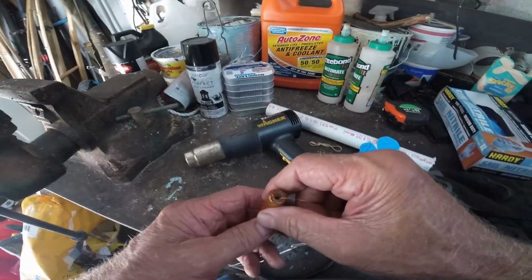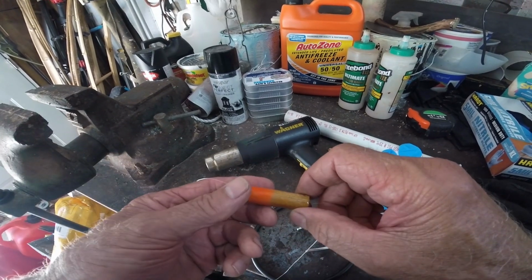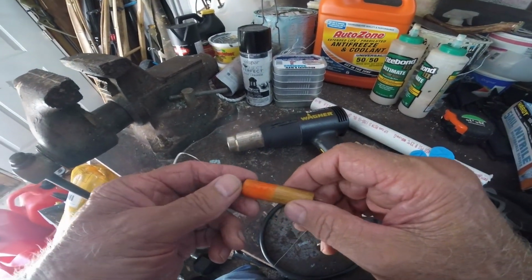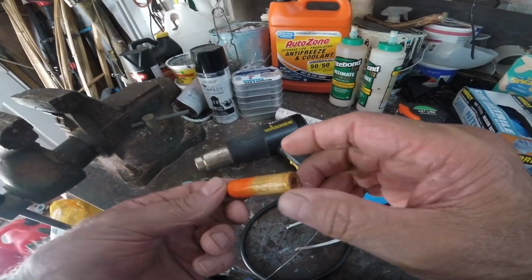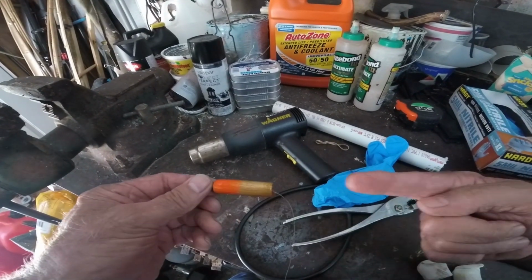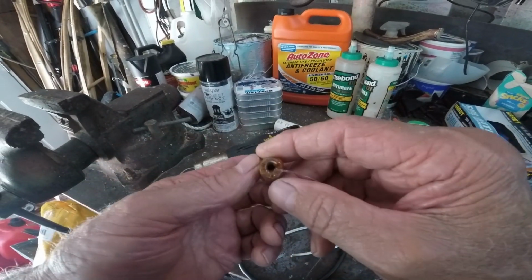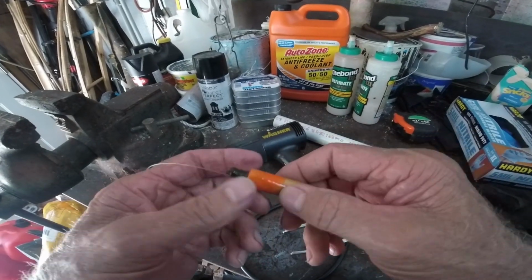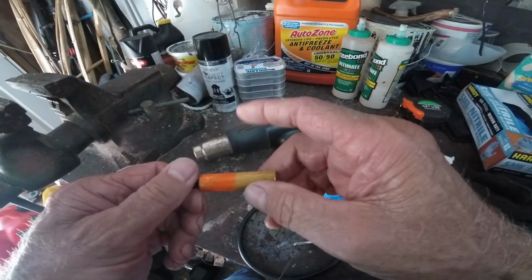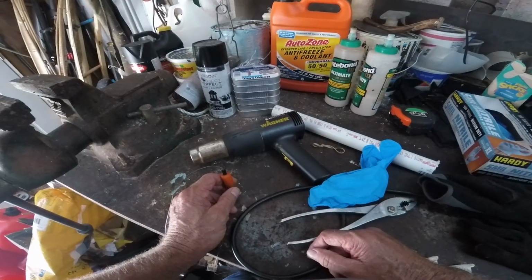You come back and I also take a little stick like a skewer, bamboo skewer, and I put epoxy on it and I go inside that hole, slick it up in there, because that's bare wood in there and salt water is going to get in there and eventually waterlog this and it's not going to be any good. So you job it up with your epoxy a little bit. And your needles here, you stick it in the foam, you let it sit for 24.